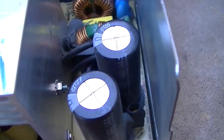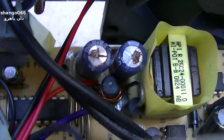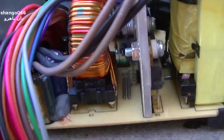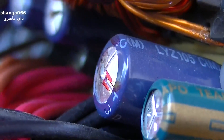These two are obviously okay — well, not obviously, but they look okay. And those down there look okay. But look at those two — completely ruptured. And let's see what we've got over here. These are all shot too, except one. Get a side view so you can see how bubbled up the tops are. This is China at its finest. You can see that one there is all bubbled up, and those there are all bubbled up.